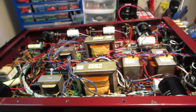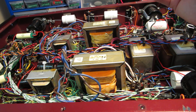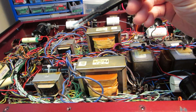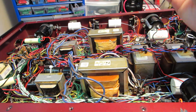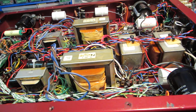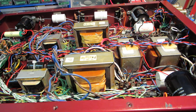And that's what I was finding all over the place — the leads were just wrapped around the sockets or the terminal strips and not soldered in place. Miraculously, this thing was working fine despite that. But I'm shocked that it did, because so far I've found six or seven connections like that in this thing, and I'm still going over it section by section just to make sure I don't miss any.